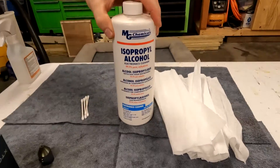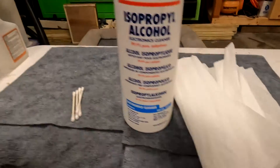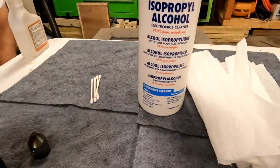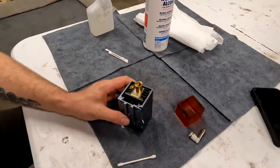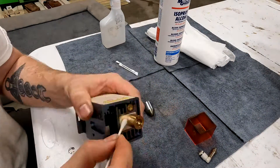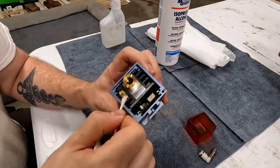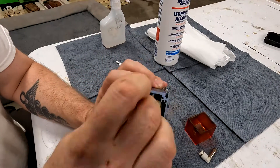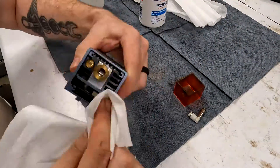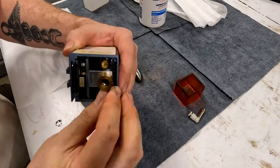Now we're going to use isopropyl alcohol to clean this — it's like 99% alcohol. That way it evaporates and doesn't leave any residue behind. I need a few cotton swabs, a couple of rags, and basically start cleaning it up. You want to use a cotton swab and clean off your laser. Clean off all the modules around it and just spray the alcohol on the cotton swab — do not spray the alcohol on the unit itself. Make sure you wipe the fins off and get down in between the fins with the cotton swabs. A lot of resin builds up in between those fins.